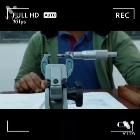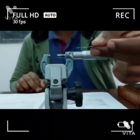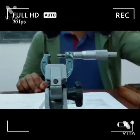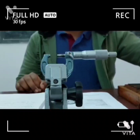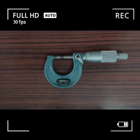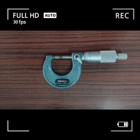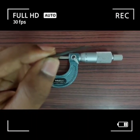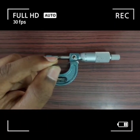For the sake of easy observations, the readings we have considered here are thicknesses of 1 mm, 2 mm, and 3 mm. The external micrometer taken for reference here has no zero error, that is, neither positive nor negative zero error. For the first reading, a slip gauge of 1 mm thickness as a standard reference is locked between the jaws of the micrometer.